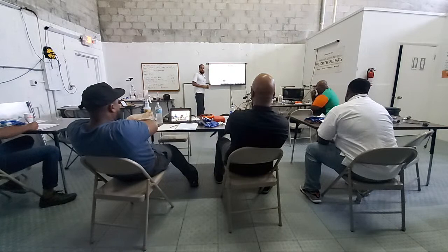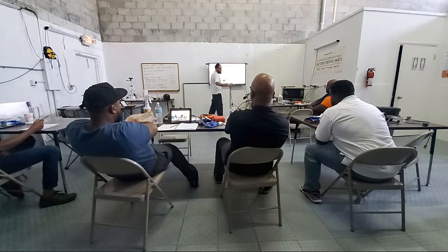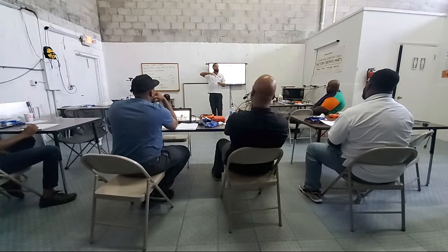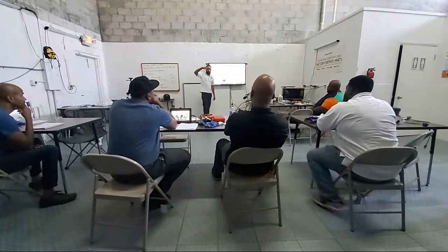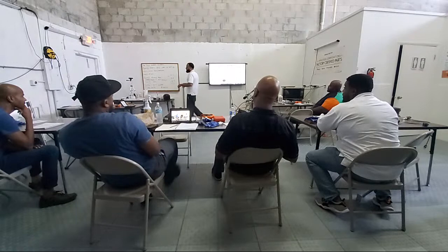I told y'all what we can do. If you want, we can unsolder here and here and perform a vacuum. That would be isolating the system, right? So we isolate both sides at that particular time. We hook up our vacuum pump, we go into our low side, and we pull the vacuum. That pressure is now in inches of mercury. We turn off the vacuum pump and close our valve. Negative, right? We close everything, make sure it's tight and closed. Where should that pressure remain? Should it want to go back up towards zero? Should it remain in inches? What should happen? It's just remaining.